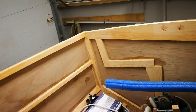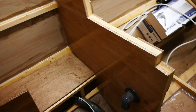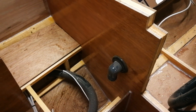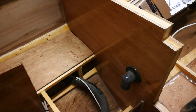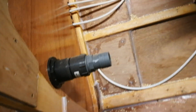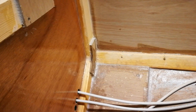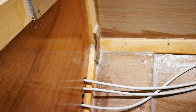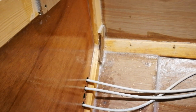As you can see here on the watertight bulkheads, I have a fitting there with a gland — the gland is the important piece here — through the watertight bulkhead, to ensure there's no water flowing from the cockpit area into the cabin. The suction pipe is going to be attached there, just haven't got to that yet. There are also some glands here for the electrical I brought through: one spare which is empty, and the other three are for solar, stern light, and the tiller pilot auto helm.